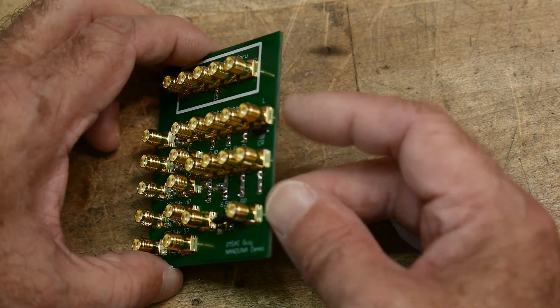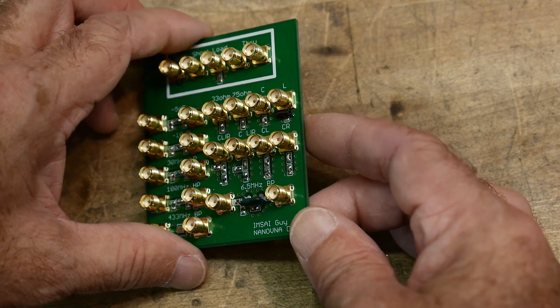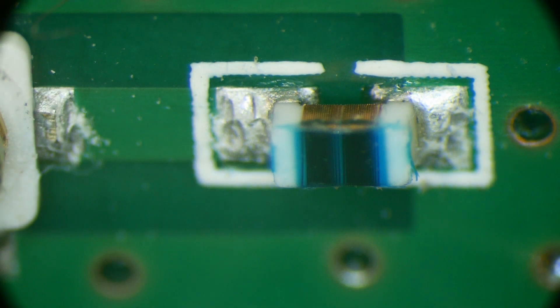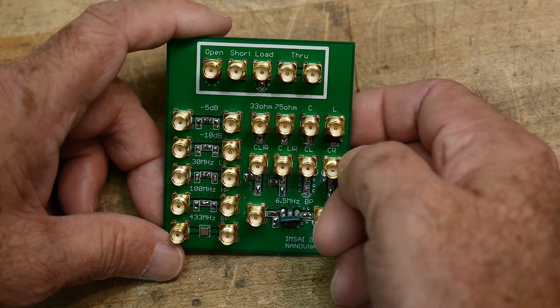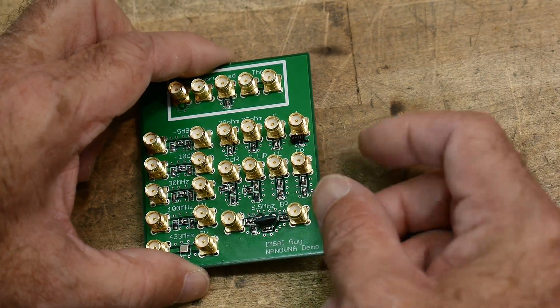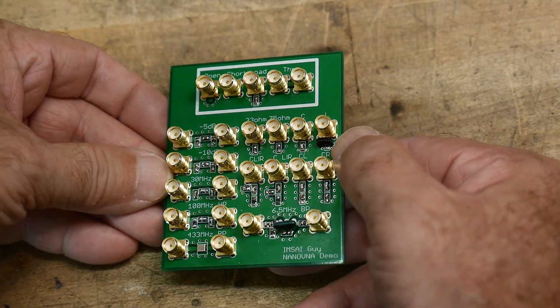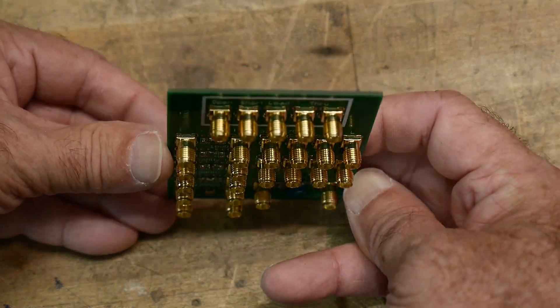There is an inductor — these little inductors are super tiny. I'll put in a picture to show you. They're a little plastic core with tiny wires wound around them, so they're real inductors. They're really easy to damage when you take them off the board — I destroyed one until I figured out how to do it correctly. I've replaced it with a little coil that I wound myself. It's not as good, but at least it's something on the board.